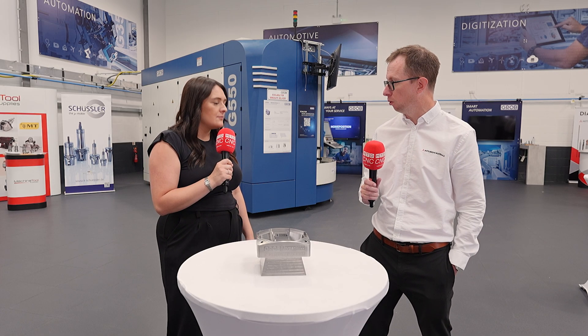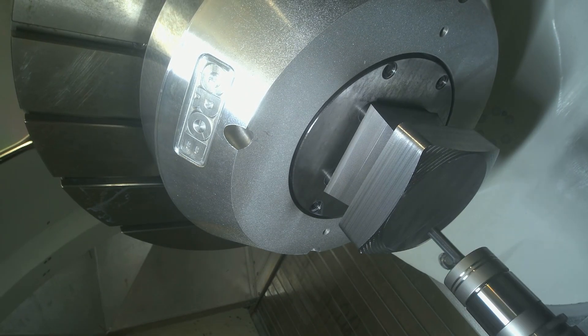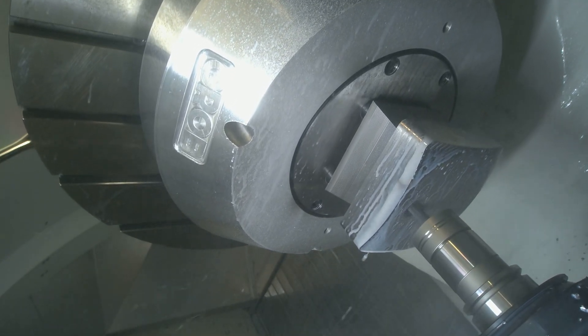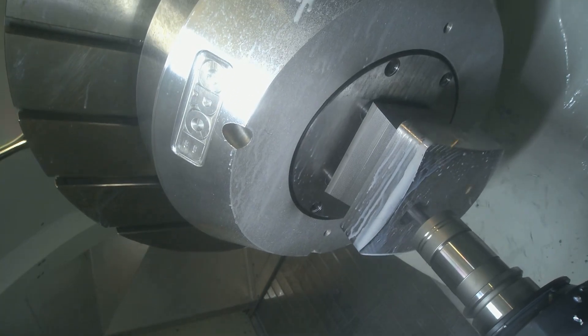The way machines are going forward is about trying to keep the load out of the spindle. Trochoidal milling puts the load through the tool vertically — or horizontally in the Grob case — so you're not putting all that load through the tool. You're running a very low step-over percentage but with high feeds, probably 10–15% step-overs on some applications. It's all about keeping efficiency.